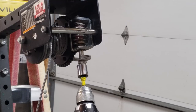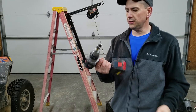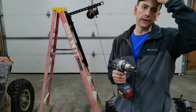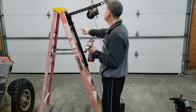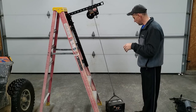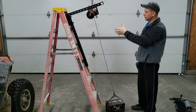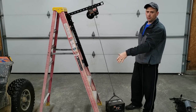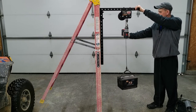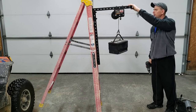You're going to be able to control your load without needing a brake — no worry about it falling down on someone. You can do it in high speed; you could do this with an impact. We've got a half inch drill here with a three-eighths drive, and a three-quarter inch socket which also matches the size bolts on the back so you can use the same socket. With the battery tied to the ladder, you just take up your slack and lift your load right up.